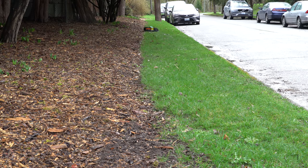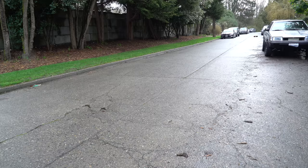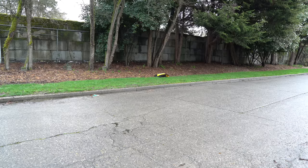Here are some shots of my first test drive in the yard. The top speed was pretty fast for a tracked vehicle, but it wasn't super fast considering it was consuming about 10 times as much power as your average e-bike — in other words, 2.5 kilowatts. These tracks weigh about 4.5 pounds each, so it takes quite a lot of power to spin them quickly.